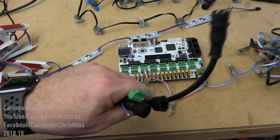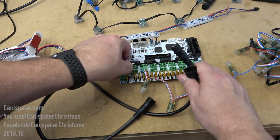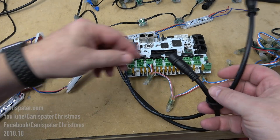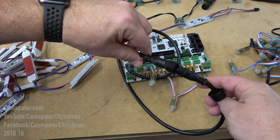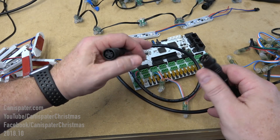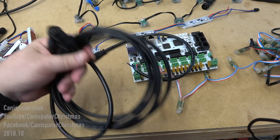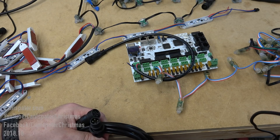The second connection method is to use some sort of pigtails. These come from Ray, so they match up with pixels that come with pigtails already. You come out from the controller with one pigtail and connect that to the pigtail on your pixels. This allows you to put an extension between these two to move them away from the controller. You could also just add a longer wire to the front of your string with a short pigtail if you don't want to pay the extra expense for extensions.